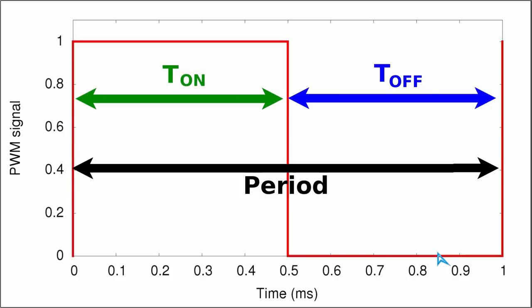The real reason for this notation is that in electronic engineering we display the logical state of a switch instead of its physical position. A logically TRUE or HIGH state means the switch is ON, whereas when the switch goes to a logically LOW or FALSE state then the switch is OFF.